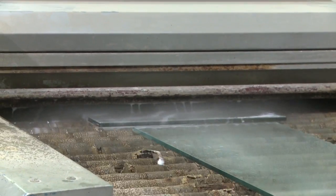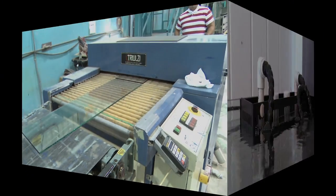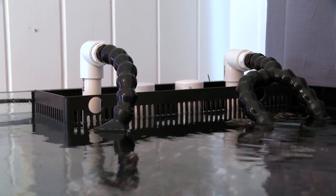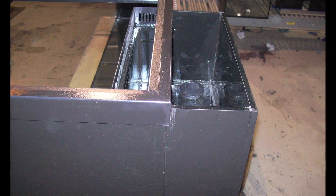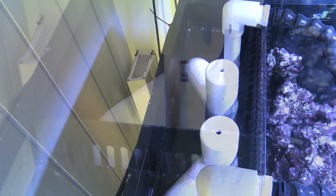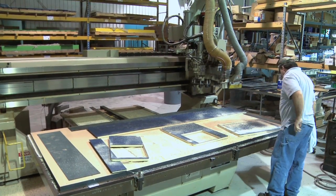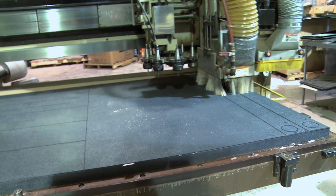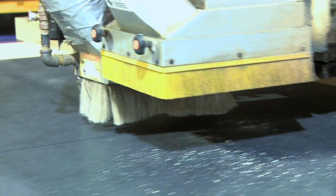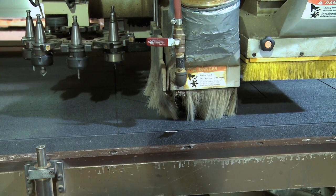After sanding, the glass gets cleaned through a not-so-high-speed glass cleaner and then put on the conveyor to be assembled. For reef-ready tanks, the tank needs an overflow. Dutch Aquarium Systems will make a tank with an external overflow or an internal one. The internal overflows are made of plastic and cut in-house on DOS's CNC machine. A computer does the driving, and the machine precisely cuts each piece of plastic, including the overflow teeth themselves — all out of one big sheet of black plastic, resulting in a precision-cut, clean overflow.